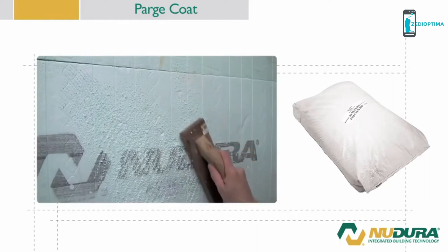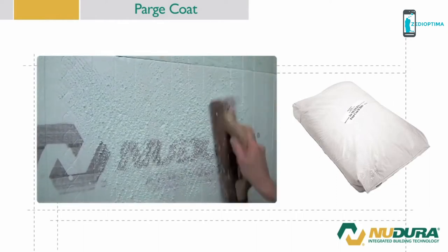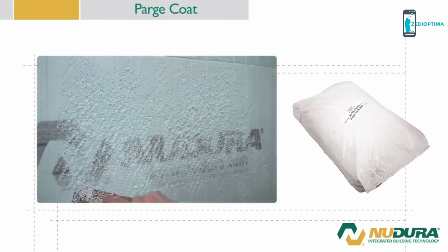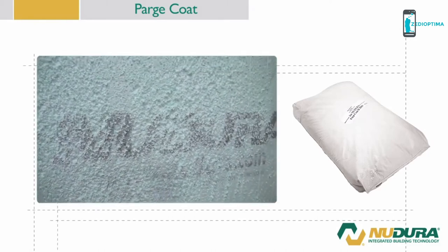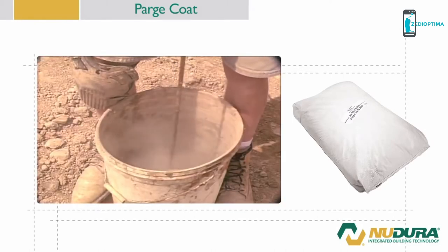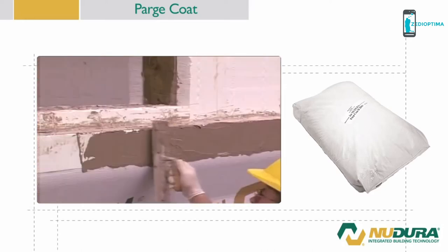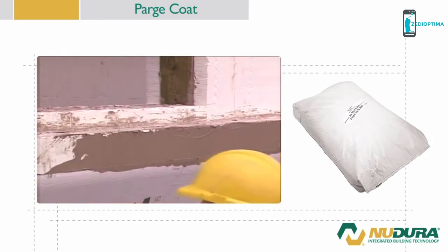The surface of the EPS foam first has to be prepared to receive the Parge coating. Start by rasping the Nudura EPS foam to improve the coating adhesion and to remove waves, bumps, and UV degradation. Prepare the parging mix coating according to the directions on the bag. Apply a base coat of parging mix overlapping the membrane by 1 inch or 25 millimeters.